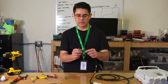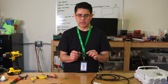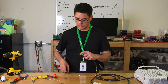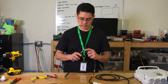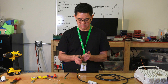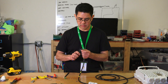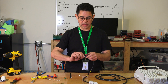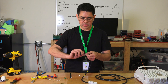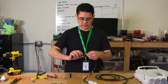Now that's shrunk down. We need to remove exactly one centimeter of insulation off the end of our conductors. Measure one centimeter and take our wire strippers. Then twist the wires together so the bundle is completely together — no loose strands sticking out — tightly twisted all the way to the end.